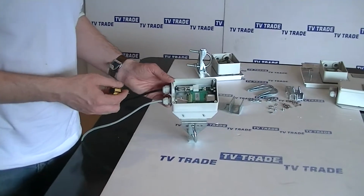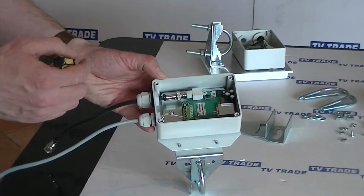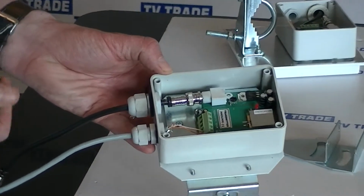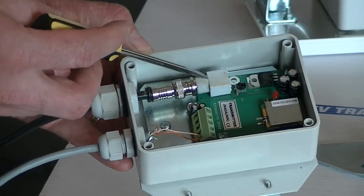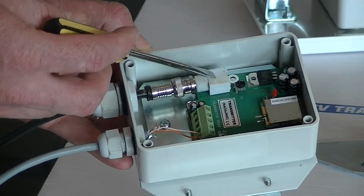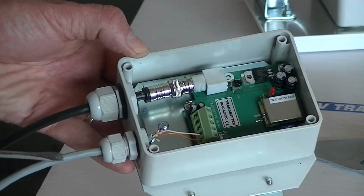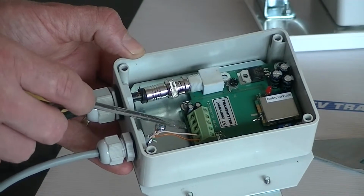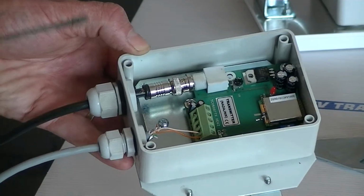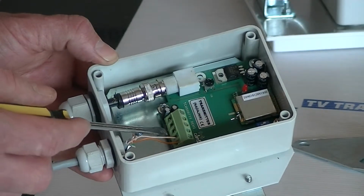So let's look at the key things here. As you can see, we have two cables coming in. This first cable here is an RG59 cable. It's coming, for example, either from a DVR or from a camera directly, and it feeds directly into this video in. If we look over here where we have some Cat5 cables wired in, we have a video ground here, and then an audio left and right where we can add in audio. In this case, we haven't got that set up. It would be unusual, but sometimes people would use that.